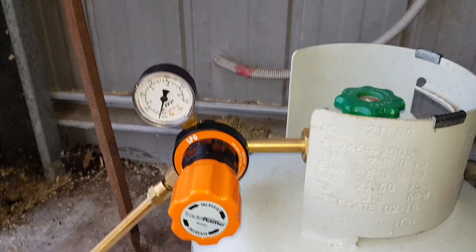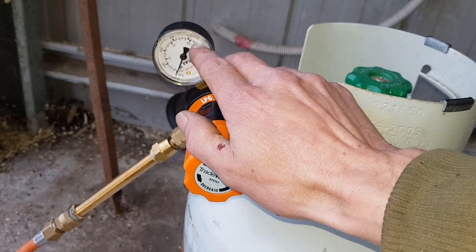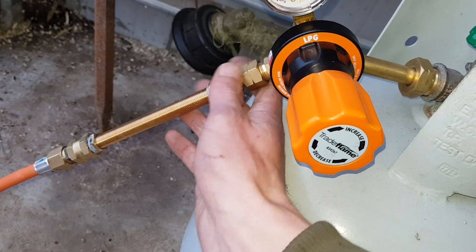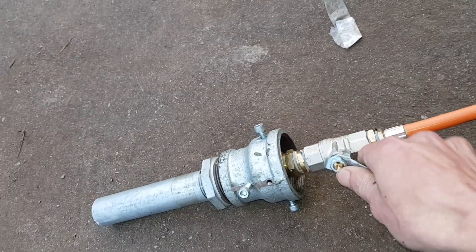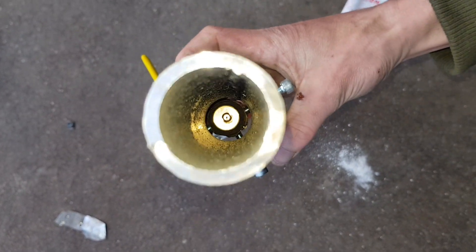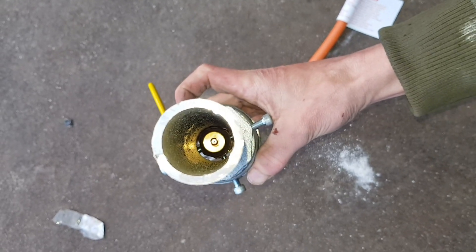Here's my latest little improvement to the setup. Got myself a new gas bottle and regulator - goes all the way from zero to 60 PSI, or a bit over. There's a little red notch there I'm assuming means too much gas. A few fittings to get the left-handed adapters on the bottle and the regulator through to the other fittings. Turns out they make gas very difficult because they don't want people playing with it. So we follow the gas line down - here's the actual burner. Right in the end of those brass fittings is just a MIG welding tip, a 0.6 mil 025. That's the nozzle for the gas.